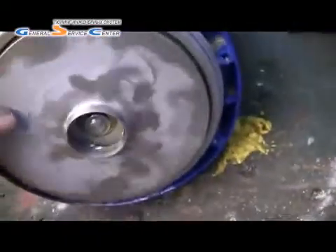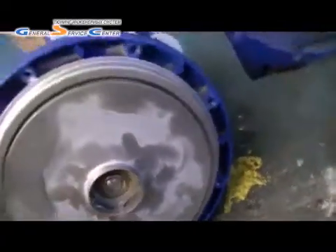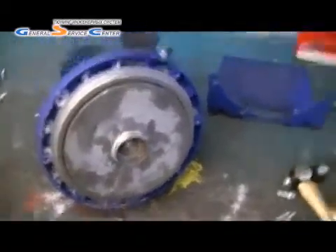Next thing to do: let's take this nut off here — that couples up to the shaft. This thing spins round. That's the pump part of it — this is the impeller. So I'm going to take this off and then I can separate the motor from the pump head entirely.